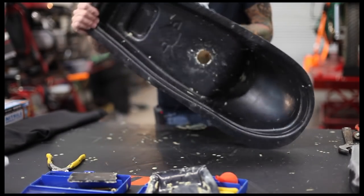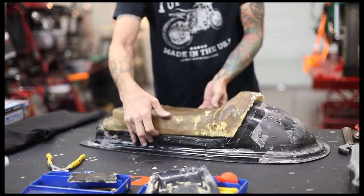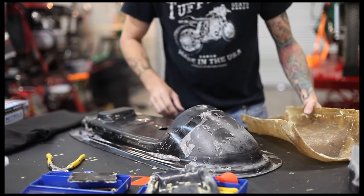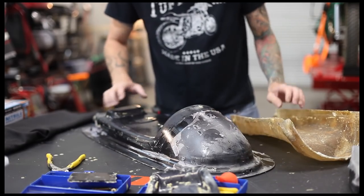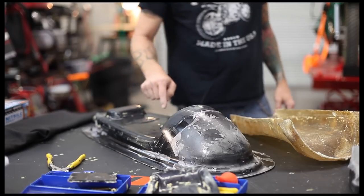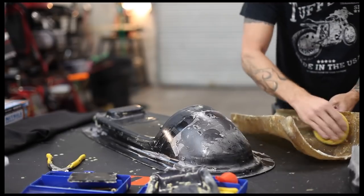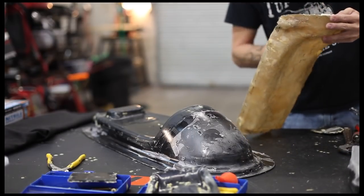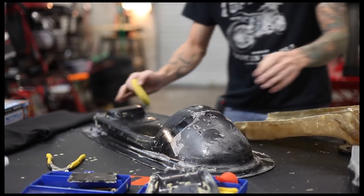It's almost a memory foam that we have made for us — it's a really nice product. A lot of companies will just use cheap crap, but trust me it feels awesome. I'm going to put a little wax on here — we don't need to every time, but once every few. Then we'll spray a mold release as well. I did this a while ago and never did a gel coat on there — if I had, my life would have been a lot easier. So let that dry a little bit — the mold release dries in about five minutes.